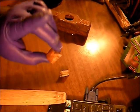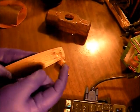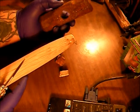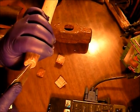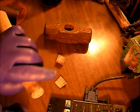Okay, so we ended up cutting this much off the tip. Now we're gonna have to trim a little bit on each side — we'll just take a pocket knife and trim a little bit at a time until it gets down in the hole and sits flush on this end. We're gonna reuse this wedge, but before we put it in we're gonna cut a little slot, probably about this deep, to keep the wood from splitting when we put the wedge back in.